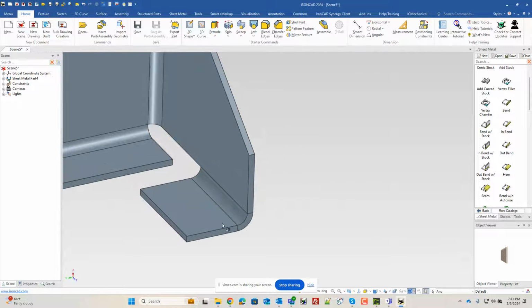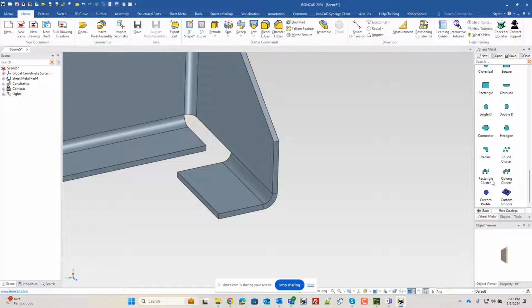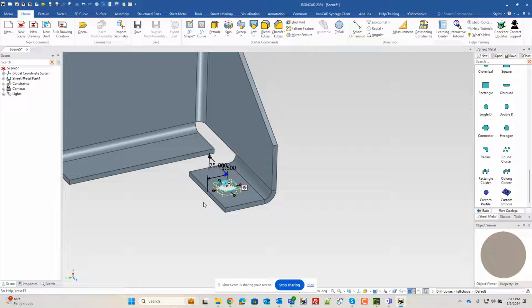And there's a hole that we need to add onto this, so we'll just drop our hole in here. I'll just drop it on the center for now. But basically, it has a distance. If we look at this, it's set out from this inside edge of our hole here. So this is our inside edge here. It's going to be an offset value of 15 from that. So we can just move that in 15 to place that. Okay, so now we have our hole in place here, and that value is supposed to be 12. Let's make sure we set that to 12 for that diameter.